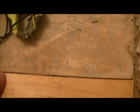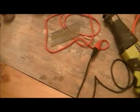And the reason why is because they have half-inch subfloor, but then they also put a second layer of half-inch ply on top of that. For whatever reason they had to do that, but that's what they did. So in order to make these two floors flush, I had to put the second layer down. And so, as I said, I've already pre-cut it and everything for the drain.